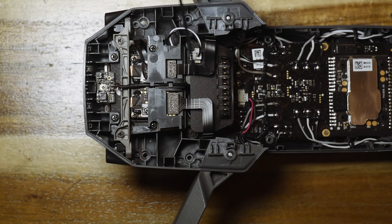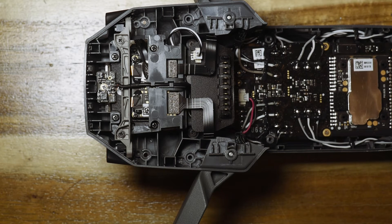Over here we have ribbon cables going to the gimbal. One of them is going to be for getting the video signal out, which is then saved to your SD card and also transmitted to your receiver. The other one will be used to get the sensor data out for the vision processing — that's the obstacle avoidance and all that kind of stuff. So these both go to the gimbal, and the gimbal control itself will reside in there as well. It'll take data from the primary MCU about the aircraft orientation and feed it back into the gimbal to tell it how to swing left and right. The gimbal also moves with stick commands — if you yaw when the aircraft isn't moving, the gimbal moves slightly to counteract the yaw.